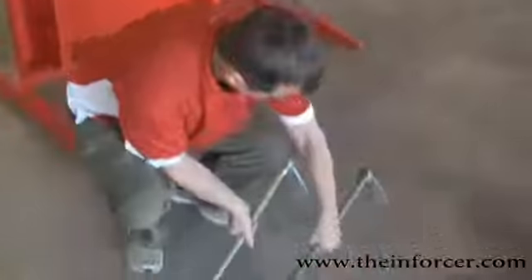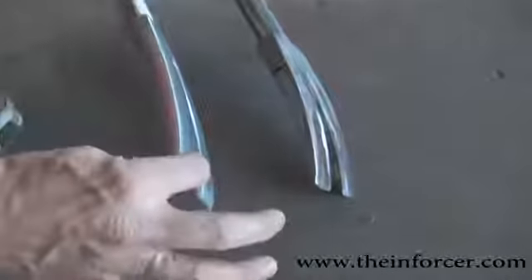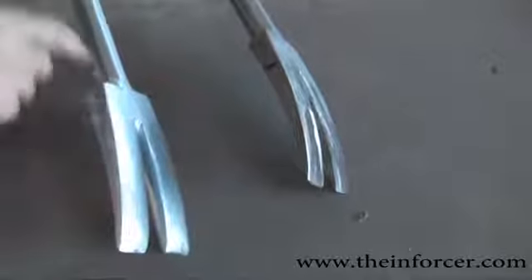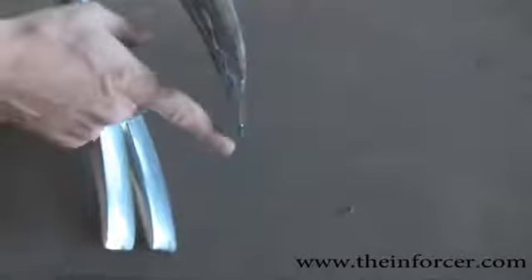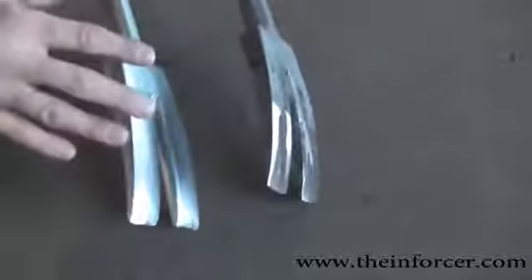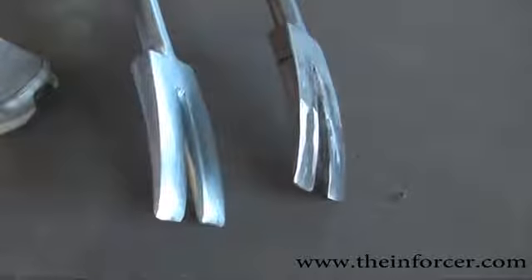Get a tight shot on these two forks. When they come from the factory, this is our one that's just right out of the box — they've got this machine edge on both sides, these little transitions. Changing that and just grinding it smooth to where there is no transition makes a huge difference when you're trying to grab the edge of the door as you're trying to get a good purchase.